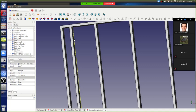Now this is tall already, the second story walls are already there. We have to put this on the second story walls. So we set up ladders and we put up joist by joist. Now all the walls have to be stabilized. They're all screwed down, bolted to each other. You have to watch out for pushing the walls out, but at this point they have a top plate, so you should not be able to push the walls out.